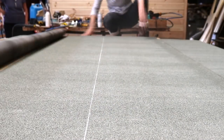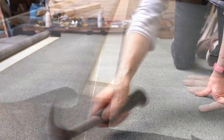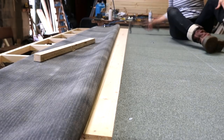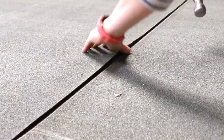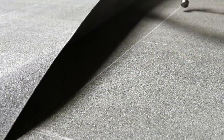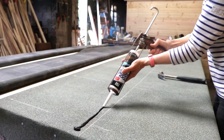So pull the top piece back again and make more reference marks where the shed's roof spars are. Then I can nail the top edge of the middle section. We then go back to the first one I nailed down, lifting the middle up to peek where my very first spar lines are, and I can create new references where I need to clamp the bottom of the middle section, because we know our distances now. With the middle one now partially fixed, I have all my reference marks as to where the top section finishes.